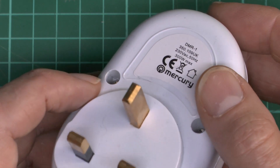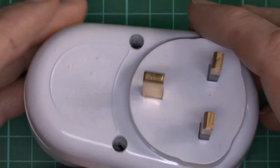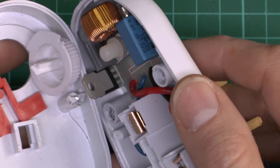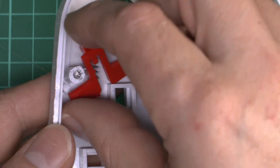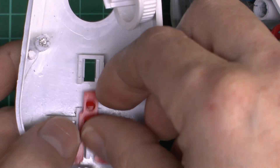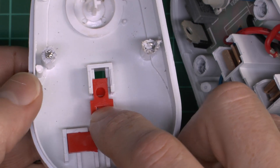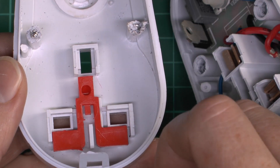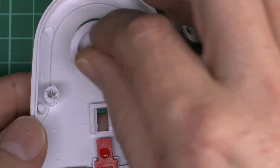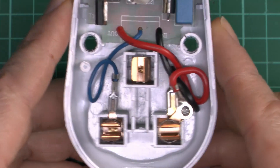It's going to have to be quite a deep and narrow tool to fit down inside the plastic. However, there are other methods of opening these things, so drilling the fasteners away is the approved choice here. Inside, in the top we've just got the actual shutter mechanism that's popped out — the usual thing where you've got a spring and the shutters just slide open with the earth pin. That's the default closed position, the spring goes in the middle, and when the pin goes in it slides down to uncover the others. Pretty standard. And then the knob just drops in and fits onto the back of the component inside.